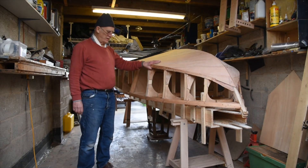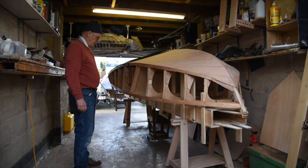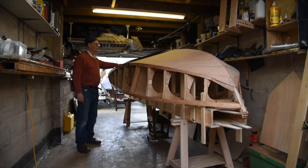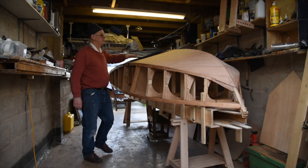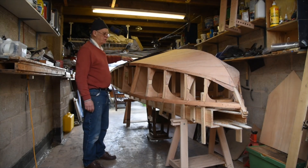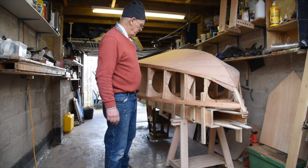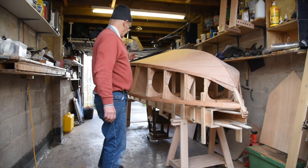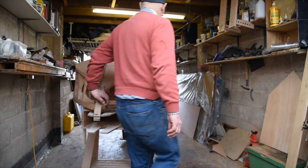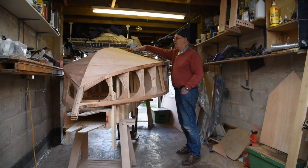Mark's the second and here's a progress report on the Woody runabout little boat. I'm on the second layer of ply, which is running that way. Got this far. Here is the scarf joint coming across. That's the first layer. The second layer is shortly due to go on there. This is simply to hold down the end of the plywood where it bends, and the scarf joint is going to come on this side.